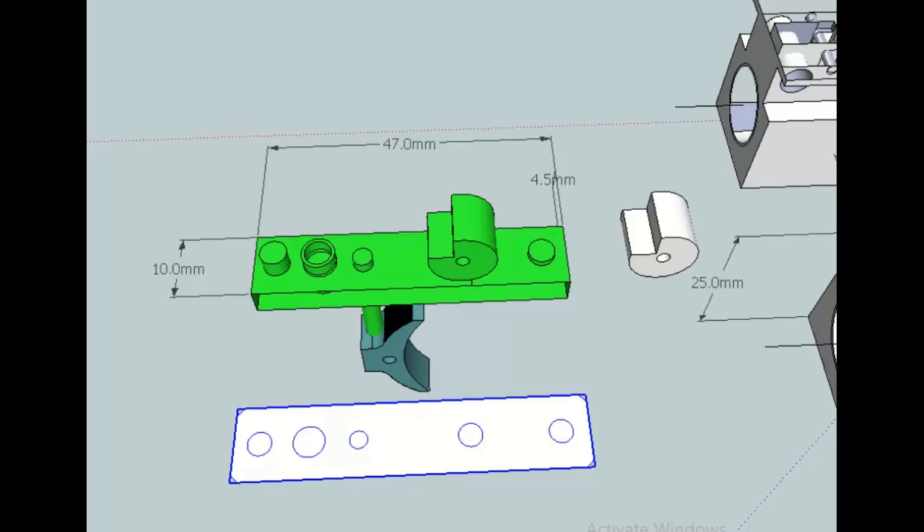That's for the safety, and maybe later I'll show you how to adjust it. The second hole is for an M5 thread - this is for the second stage spring, spring-loaded grub screw. The third hole is M3 threaded. The fourth hole is M3 with no thread. And the last one on the right nose is threaded for an M4 grub screw.